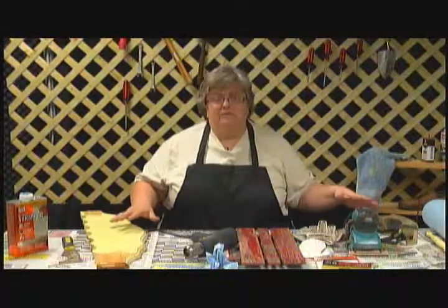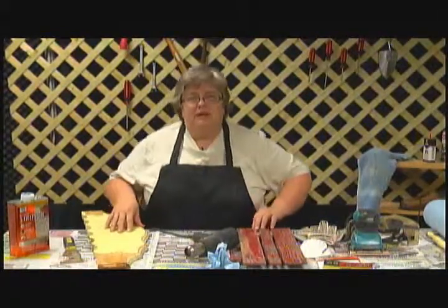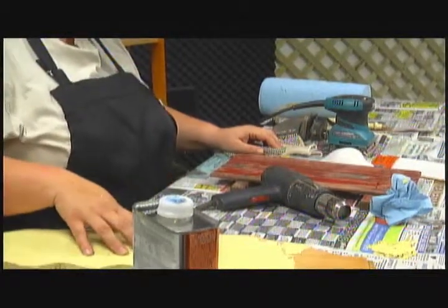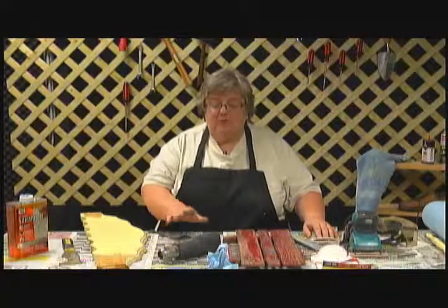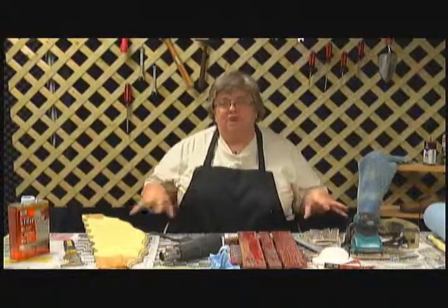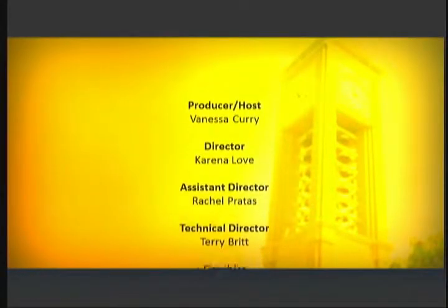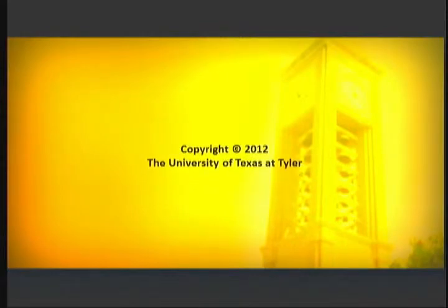As you can see, we have four different methods, and you can combine them — whatever is best for you. Once you finish scraping off all the paint, you have to sand it lightly to smooth out the surface. Then you're ready whether to paint or to stain your project. Make sure after you're finished to clean up your area and dispose of all the products, and then you'll have your project ready. Until next time, this has been Handy Home. I'll see you next time.